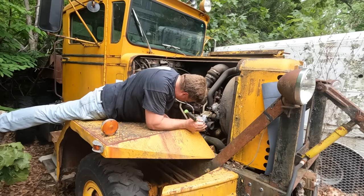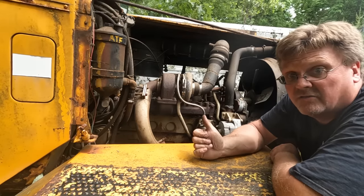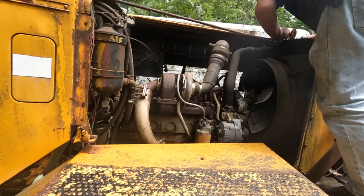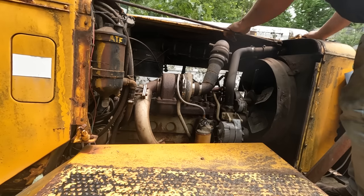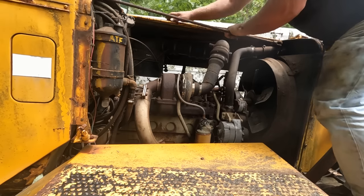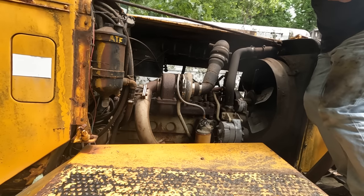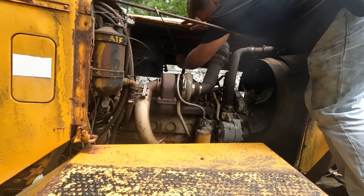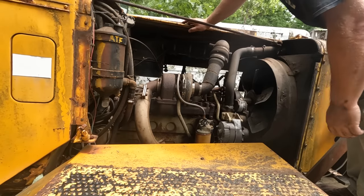It's in. Now I gotta get out. Now that I actually think this is gonna start turning over, I'm gonna check the fluids. Yeah, hopefully it has some. Radiator looks dry, so that's not necessarily good. There's a dipstick behind the spider web, huh? Oil's really over full. Well, at least it has some. Let's see if it turns into a milkshake when I turn it over. Well, I guess that's all that really matters.